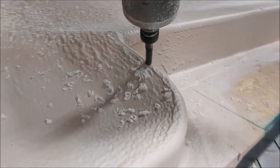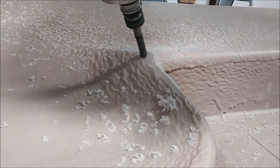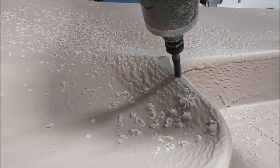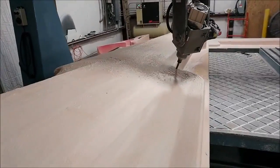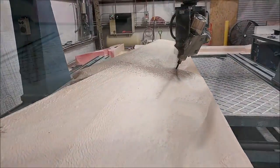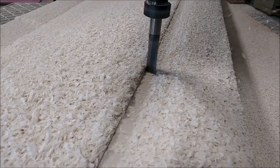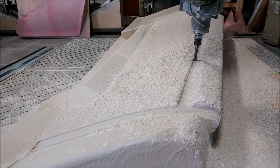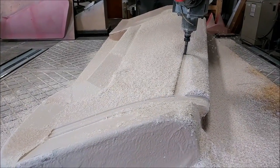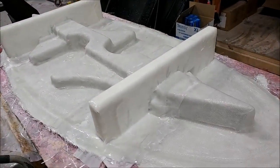A bit of a milestone with these big ones - it's going to be weird one day when we don't have any big platforms to mill anymore. A little further along, the flanges are done on the first half and it's moved on to the top skin. I do the top skin with a reasonable step-over and then the leading edge with a much tighter step-over.